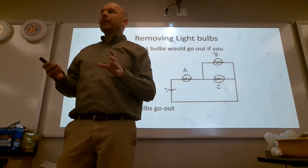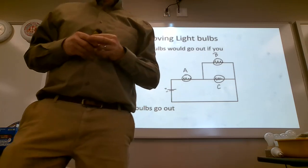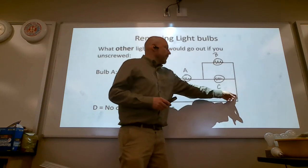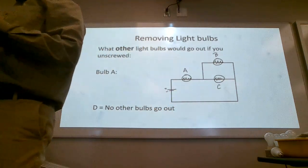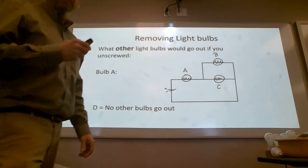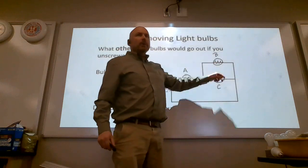This is not a complete circuit. Here's the number one rule when evaluating these: current cannot go in two different directions in the same wire. This would be current going in two different directions in the same wire — it's like having water going two different directions in a hose. That's just weird.